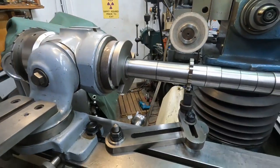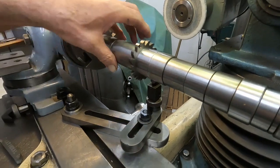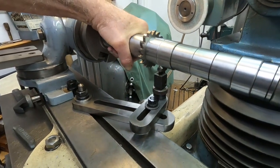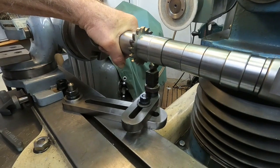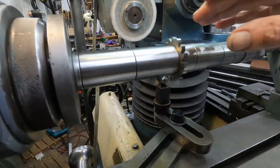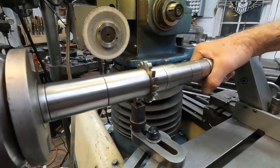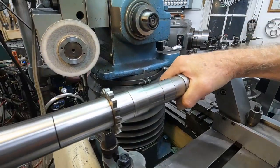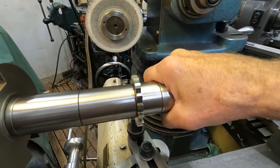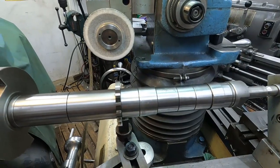In the meantime I'm going to grind some of these other cutters I have here. I'd like to get better results than I did on that last one. Here's a 15-tooth cutter — it says it's 5/16ths but somebody ground it width-wise down to a quarter inch. It's got three angles on it that I can see, and I'll inspect that next.